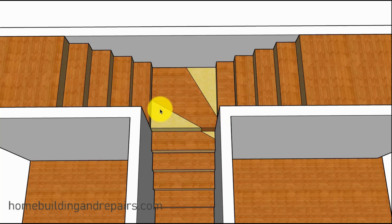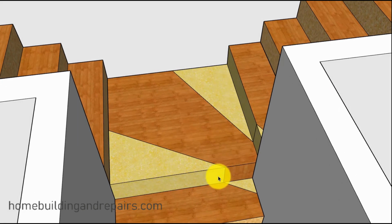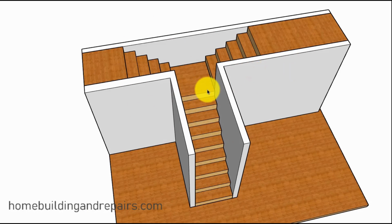And of course, here we raised the stairway up and filled the landing in. And again, we just did a little more modifications, did it a little different to get what we wanted it to look like. Instead of tearing everything apart, you might actually be able to just do some modifications to the stairway to get it to work. Especially if you're going to put carpeting over it. If you're going to use hardwoods or something where making the modifications might put a hump in the wood, or make it not perfectly flat, that could be a problem.